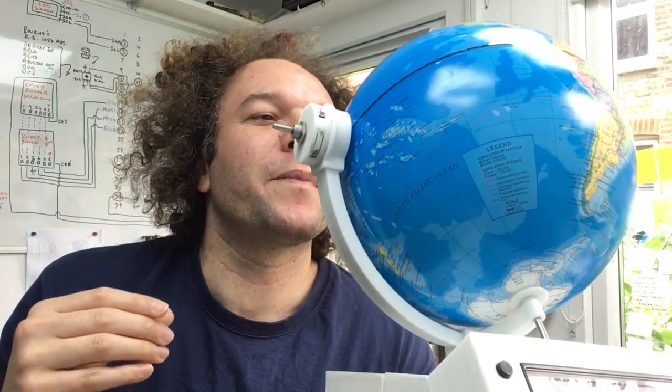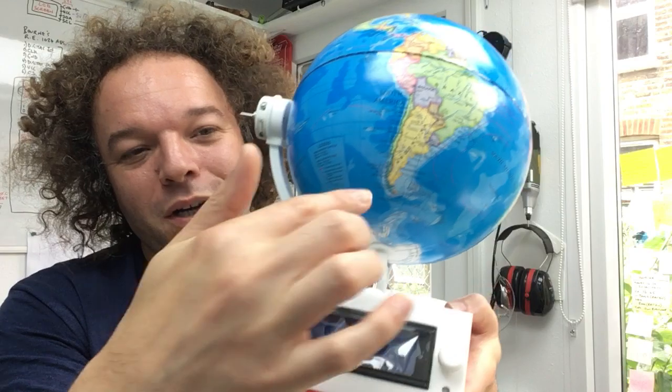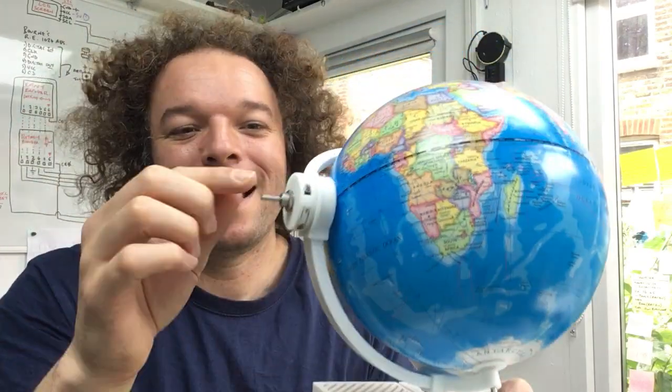However, 20 increments doesn't cut it for 360 degrees. So what's incredible is that this rotary encoder — a Bourns rotary encoder — is basically slicing the globe. It has 1024 positions, and in many ways you would not be able to make this without two of these rotary encoders: one doing the spindle and this one doing the wiper up and down.